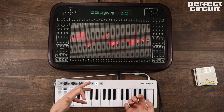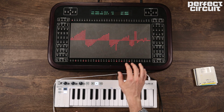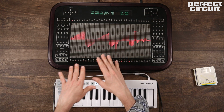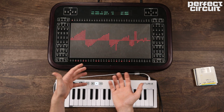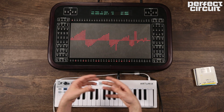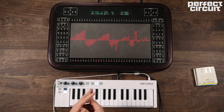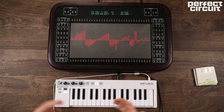Often for recreating sampled sound, that requires way more than the 32 oscillators and amplifiers we have per voice in this kind of from-scratch additive synthesis mode. So it basically has the ability to take resources from multiple voices and join them together into one mega voice that uses as many cells as it thinks that it needs in order to do things.